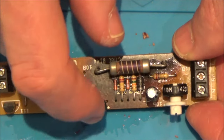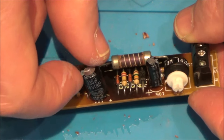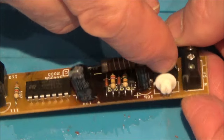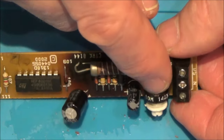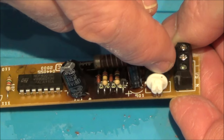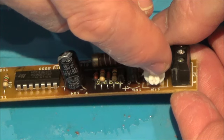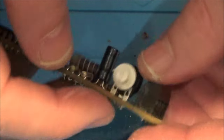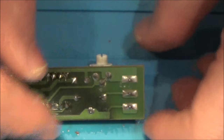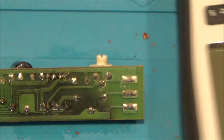If the capacitors have to store energy for a certain amount of time, maybe one could be faulty. Or maybe this thing — no matter what — is only registering for example 30 or 40 seconds, no matter where you put it, registering the same. I should be able to measure that. If I go onto the pins at the bottom — it looks like there's three pins — and put my meter to ohms, then by turning the top I should be able to get some kind of different reading. Let's zoom out a little bit.